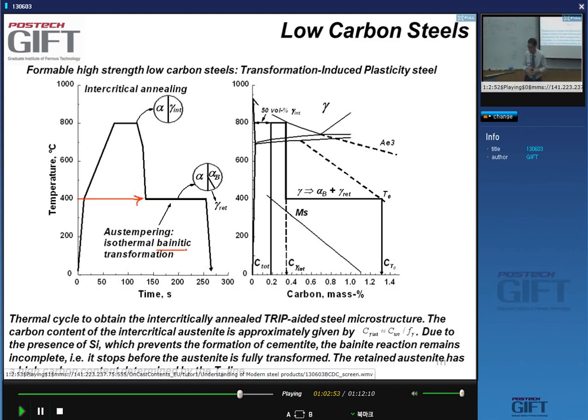So that means that this austenite transforms to bainitic ferrite and retained austenite. It's a low temperature transformation where the substitutional elements don't move, so we have a so-called para-equilibrium situation. The carbon can partition and the other elements don't partition. So we make bainitic ferrite and gradually enrich the retained austenite in carbon. And then when we cool down, this retained austenite has so much carbon that it doesn't transform anymore. It's been stabilized at room temperature.